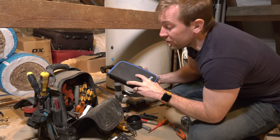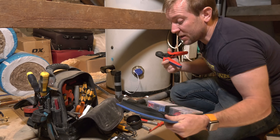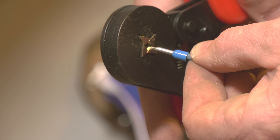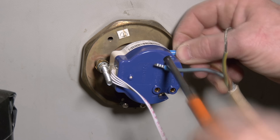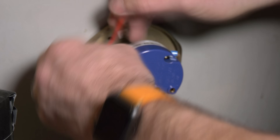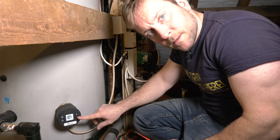Make sure the wire is protected as we go back down. If you can, it's a good idea to use crimps because you get a much better electrical connection. I've got a crimp set here with loads of different sizes of crimps and a crimper that I've used in previous videos — you can find that on the Amazon store too. For the earth, what I tend to do is leave the wire longer, then wrap it a few times around the stud and tighten that up. You can already see the advantage of doing that. Little tip: leave the earth wire long and wrap it in the direction you're going to tighten. Now we just rebuild the T-Smart like I showed you in the studio, put the fuse back in, throw the switch.